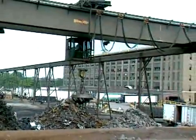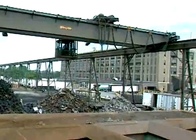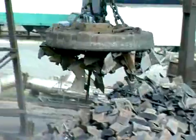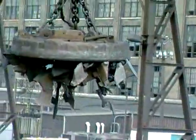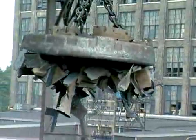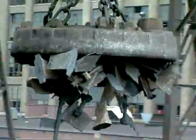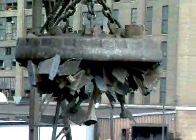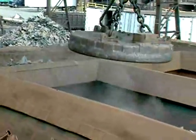The Kohler industrial casting production process begins with the delivery of scrap iron and steel to the Kohler Company grounds. 98% of the metal used to produce Kohler cast iron products is recycled. 100% of all incoming scrap materials are inspected for compliance to Kohler Company standards. After combination with internal foundry returns, they are delivered to the charge station with an electromagnet.